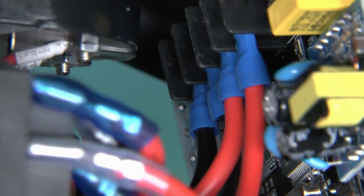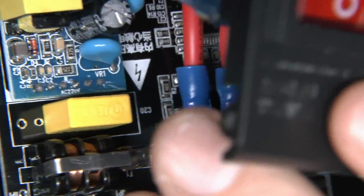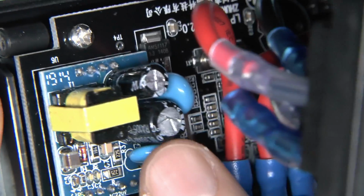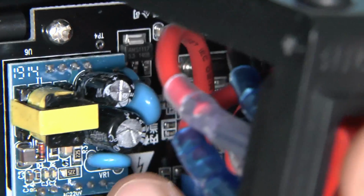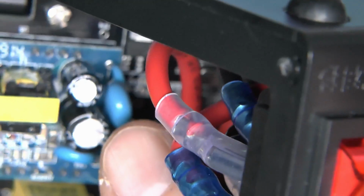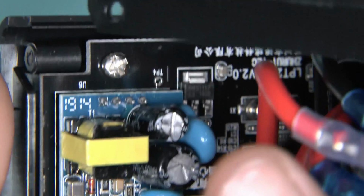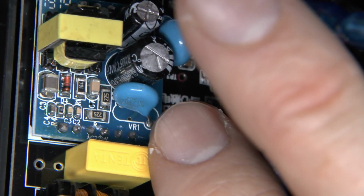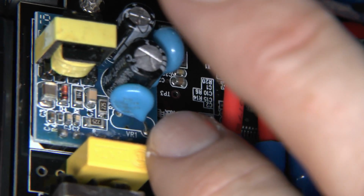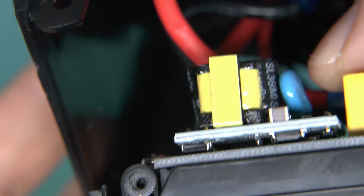YW may be the brand there, but anyway, not one that really comes to mind as any one that you've heard of. And the little power supply board, it's obviously a separate unit. They presumably have just different ones that plug in here for different input voltages, so that would make sense. So yeah, it's got a couple of metal oxide varistors on there, and just a few other little bits and pieces at the bottom. Yes, don't see any active components on there, which is, oh, they're on the bottom, that's why. There we go. Look, there's obviously a couple of chips on the underside of that board.